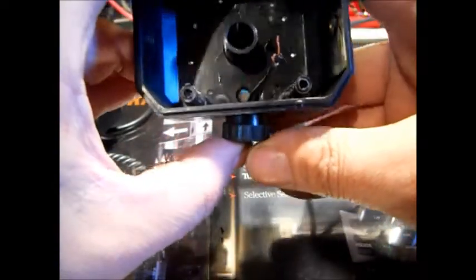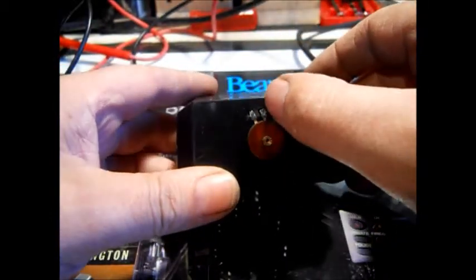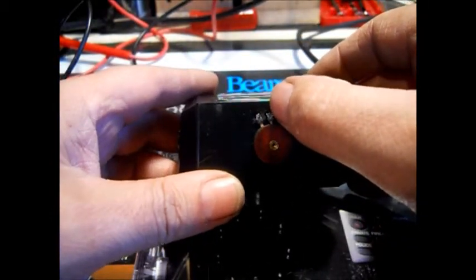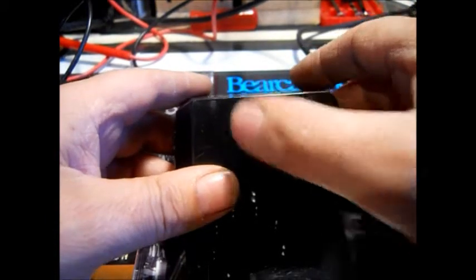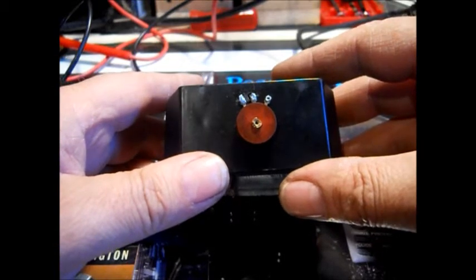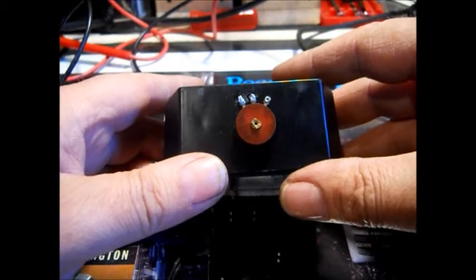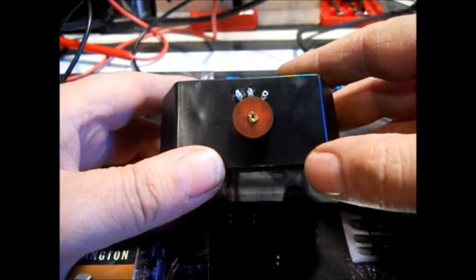Here's where the speaker wire comes in the back. I always turn the knob this direction. I have the hot side coming in here, so I'm going to put it on the hot side of the speaker line. Here's the line going out — we will be splicing in to the hot wire going to the speaker. We're just going to cut the hot side and splice this in, and I'll show that when I'm done.